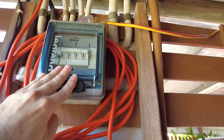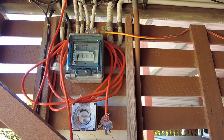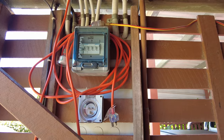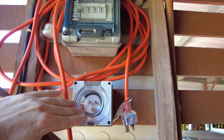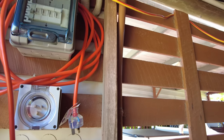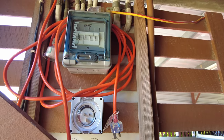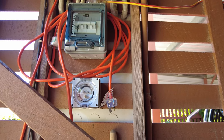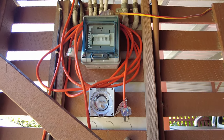The goal isn't to power the entire house — mainly just to run lights or a fridge without running extension leads. I went with a 15 amp connection so if I upgrade to an AC300 or AC500 in the future I can put extra current into the board. I've also got a Dewalt generator with a 15 amp output, so in an emergency I could use the generator during the day, let the Bluetti charge, then swap over at night.